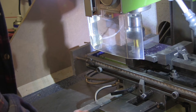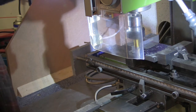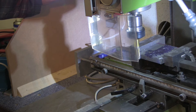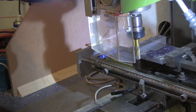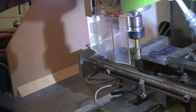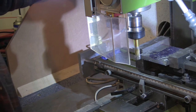I'm just going to touch it off. That's about it. Unfortunately when I did this power feed I only got a 25 rpm motor, which is fine for actually milling, but when you're going backwards and forwards with it, it's a bit of a pain. A big pain actually.